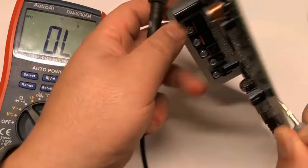Now with this board: for this chip you're going to see pin number 7 and pin number 8 both beep — and they shouldn't beep. This board got dragged through and this chip needs to be replaced.